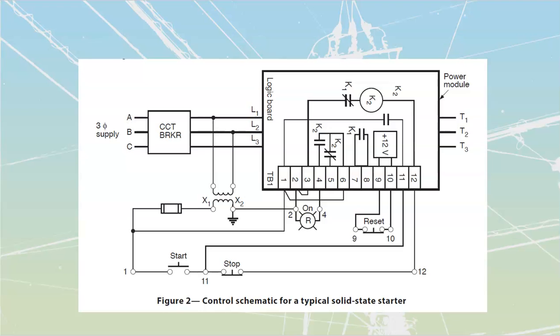Another thing to point out is that most drives, regardless of family, are going to have something like this — we call it a dry contact. A dry contact means it's not connected to any power source unless you externally connect it. They've got a common with a normally open and a normally closed. I can use those to fire anything else — I could even run it off of a different power source. For example, I could feed in 230 volts onto that dry contact, run through normally open or closed contacts, and use it for indicating lights or auxiliary contacts.